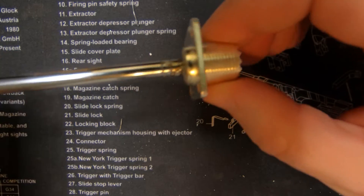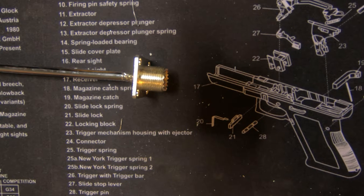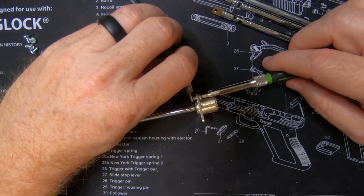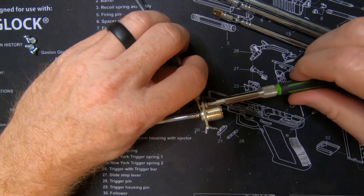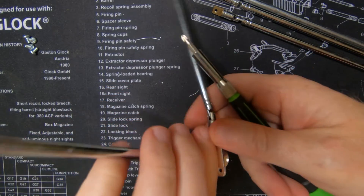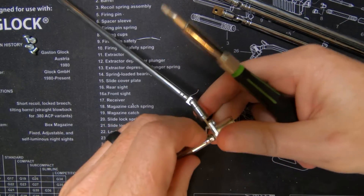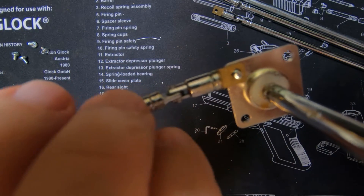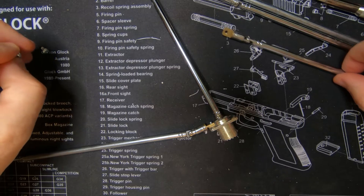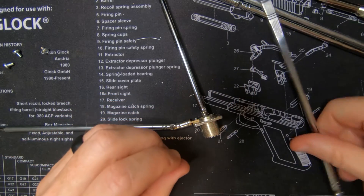Now that we have this telescoping antenna attached to the SO239, the next step is going to be to attach the radials. We're going to put the screw through the SO239 and then screw that into the telescoping antenna and tighten it down, pretty even with the edge. I've seen some people put a bolt on top or use two-part epoxy, but I'm just going to solder them and we'll be done.